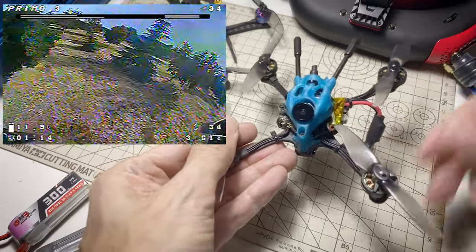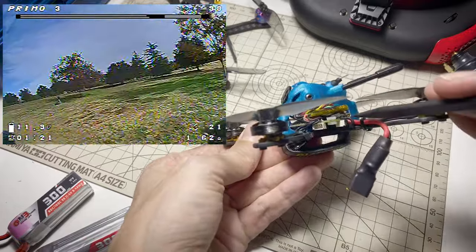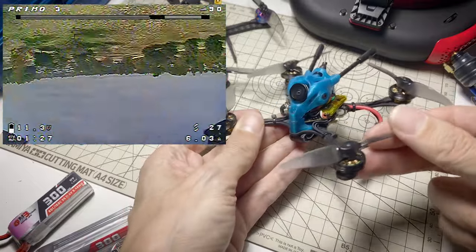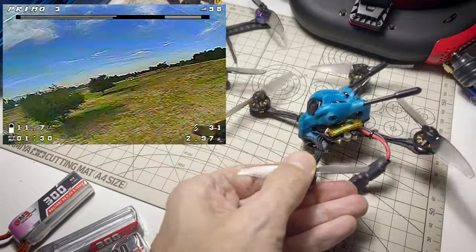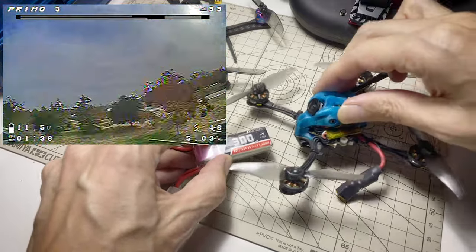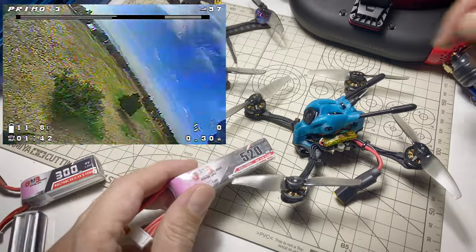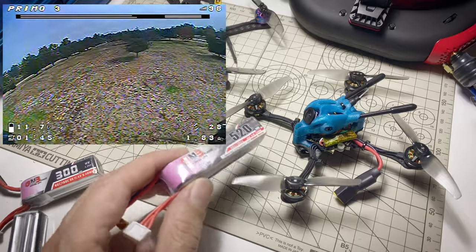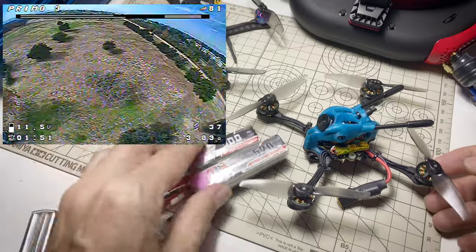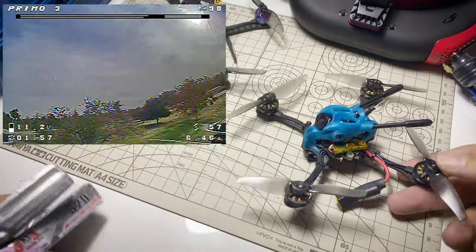This is still the best thing I've flown this year — and not only is it the frame, but it's also the Beta FPV toothpick board with the flat layout, which is really excellent. But I think the biggest thing are these 1303 motors — they're just so powerful and efficient, a terrific flying experience. Today I was flying it on a little 300mAh battery for about four minutes with plenty of power. If you fly it with something like a 520, you can fly for probably even up to seven minutes. The motors come down cool, so it's obviously a very efficient yet powerful setup — my favorite so far, and great on any battery between those ranges. These motors and this frame are a great combination.